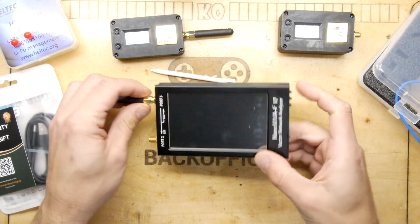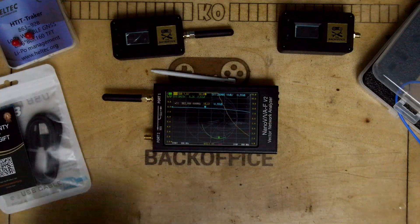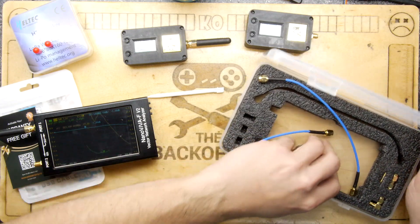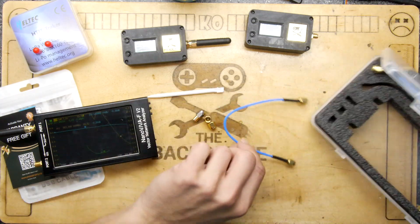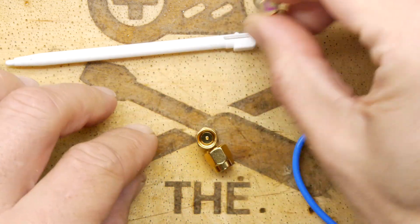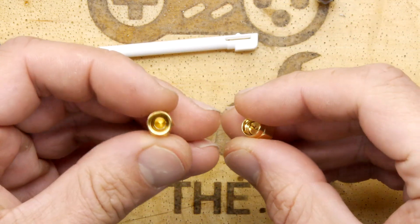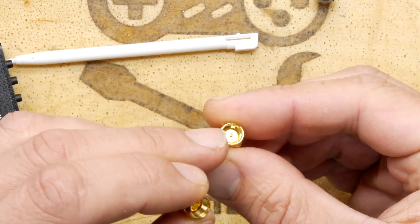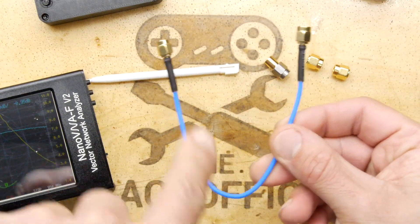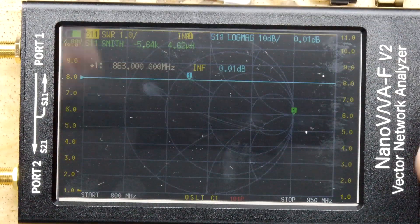This was a bit of a rollercoaster. I ended up having to phone a friend because a YouTube video wasn't massively helpful. However, now I can tell you what all these things are. This kit is actually a calibration kit. You have these items: that's your Load (L), that's a Short (S), and then Open (O). Turned around: the open has nothing inside, the short has a little pin in it, and the load is a bit longer. Then you have the Through — it's nothing more than a U-shape, in and out.